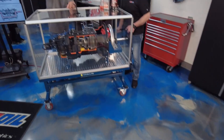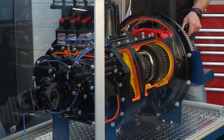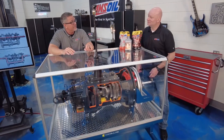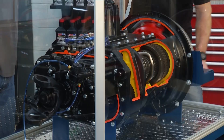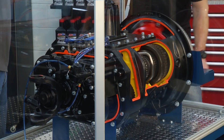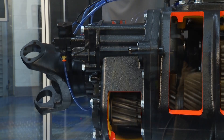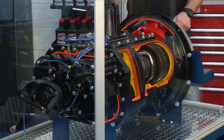On the other hand, this monster — this is out of a semi-truck. This is a semi-truck manual transmission, and we can achieve a ton of gears here. I'll show you — you can use the same gear to achieve a ton of gears with this auxiliary here. I'm going to go down there and put it in first gear. You can see the output spinning pretty slow. And what I do is I'll come out for a minute, hit that lock which locks this auxiliary, go back to that same gear, and we're actually in fifth gear. So that's pretty wild — you can do that through all the gears. This thing is massive.